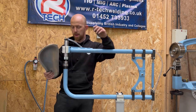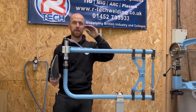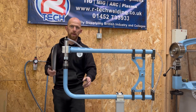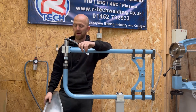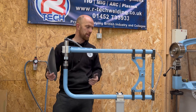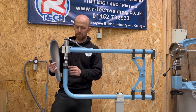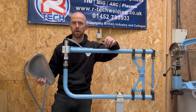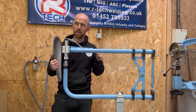I've seen on Instagram where you can detach this machine from the stand — if you had a dent in the roof, for example, you could get it into the middle. It has a 27 inch throat and an 11 inch drop, so you've got loads of room to get into panels and planish areas. The quick release is fantastic — it takes seconds. Probably the longest part is undoing the four grub screws. The foot pedal is a great upgrade, and the water trap and oiler are also great features.